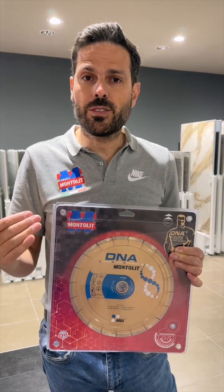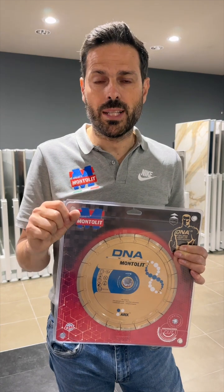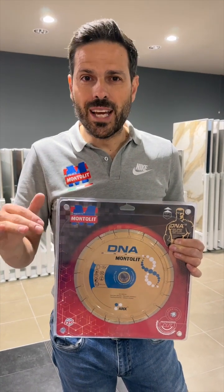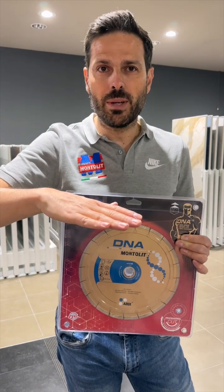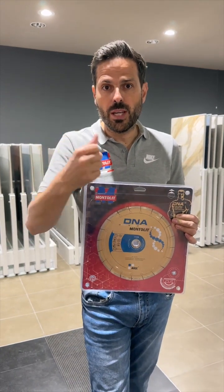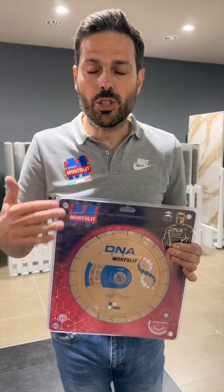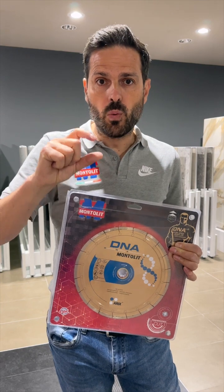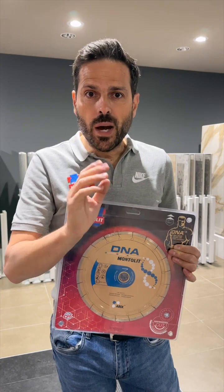In the next video you're going to see me cutting 2 centimeter porcelain tile at real speed. After that, for a crazy test, I put a 2 centimeter porcelain tile on top of another, so 4 centimeters, and as you are going to see, I'm cutting easily too. And again, to exaggerate and show the quality of the blade, I put 3 tiles of 2 centimeter one on top of the other, and I went through in one shot, removing 3 millimeters from the side.